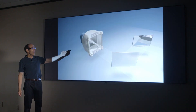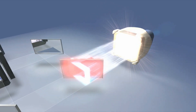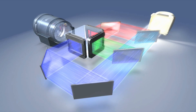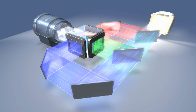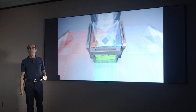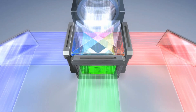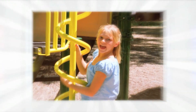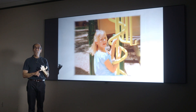White light comes out of the lamp and strikes the first mirror filter. Red gets reflected off, green gets peeled off, blue goes around the block. The three color lights strike the identical LCD chips, and the crystals do their job — they twist a quarter of a turn and they're forming an image. In this case, a red girl, a blue girl, and a green girl. Where does the realistic flesh-tone girl come from? She's formed inside the prism by the correct addition of the three colors. Then the projection lenses take over and amplify the image, making it bigger. 90 inches is good, 120 is amazing, 130 is mind-blowing, and 150 — nothing short of breathtaking.